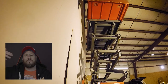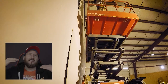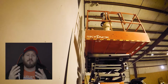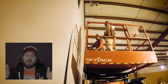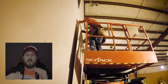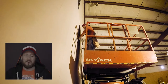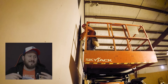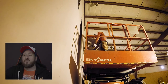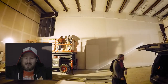When I'm doing my tops, same thing — I screw the first layer in every two feet, even if it's a single-layer wall. Tack them in every two feet and then at the end come back and screw off the bevels, because if you screw up all the bevel first, there's the possibility of them being busted out and pushing your sheets out. It's nice to just tack them in lightly. When you're on a lift, once you get all the sheets in your area, screw them off — always screw off coming down.